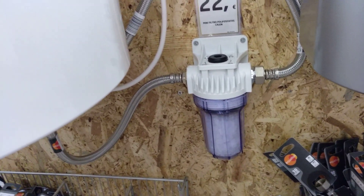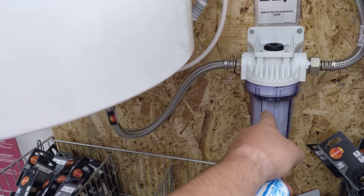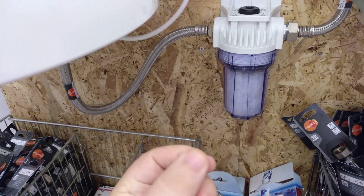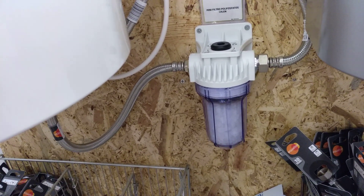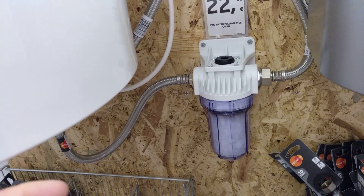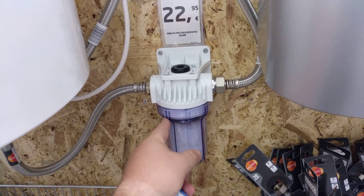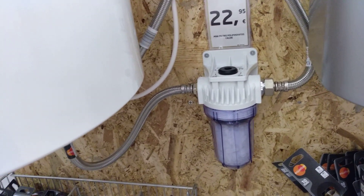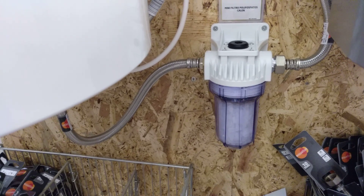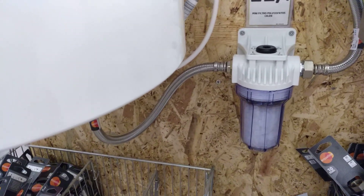The tank was just replaced three years ago but it just needs a pre-filter in there, because what it's had is little minerals, bits of stone. They get inside the tank and with the heat it's sort of abrasive on the side and bursts the tank. So we're looking at getting one of these today — we've just replaced the tank, going to put a new filter in, drain it all down again, clean it out, and then add the filter on.